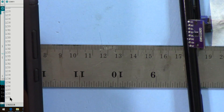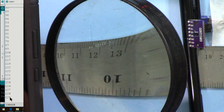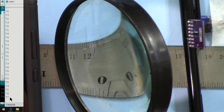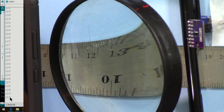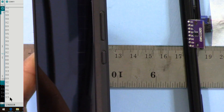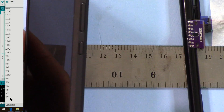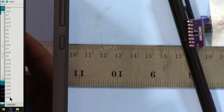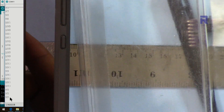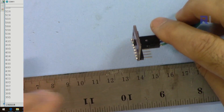I'm now placing a magnifying glass in front of the sensor to see if glass has any effect. At an angle it makes some difference because it reflects the beam elsewhere, but when the glass is perpendicular to the laser beam it has no effect. Testing with a plastic device case also shows no difference — we still get about 100 to 105 millimeters, the same as without it.